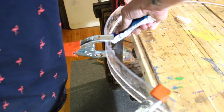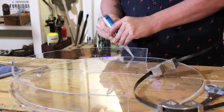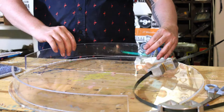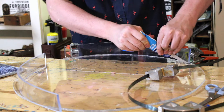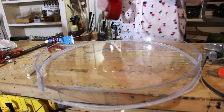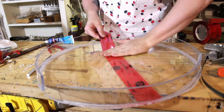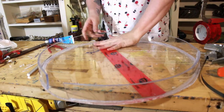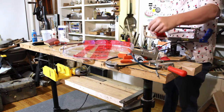So you notice that I have this acrylic I'm making into a mold. I use the oven to heat it up so I can bend it better. I don't remember the temperature I put it in at, but it was probably pretty low. Right now I'm using tuck tape to seal it all up where the Loctite silicone sealant might not have done the best job. Putting a hacksaw upside down in the clamp to cut the tape instead of using scissors is the move.